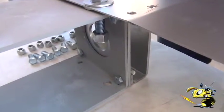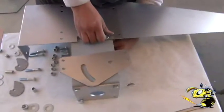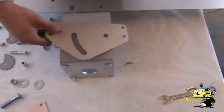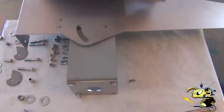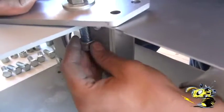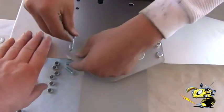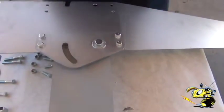We're going to snug that up. We forgot a piece — we forgot to put this one on. You can forget a lot of pieces. This is our main plate — put it on, and then push the main bolt through, and then we tighten. We'll get it real tight later. This bolts the heavy quarter-inch plate and makes it basically one piece with the sheet metal body — it's a strong point to pull it all together.